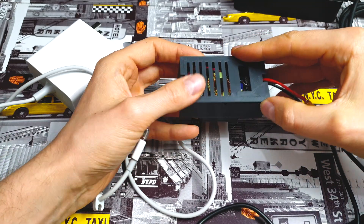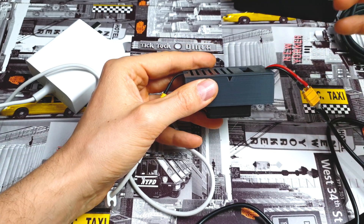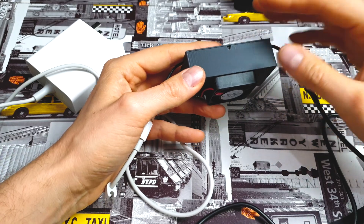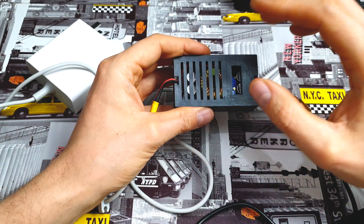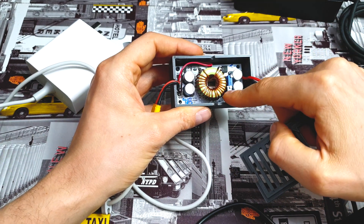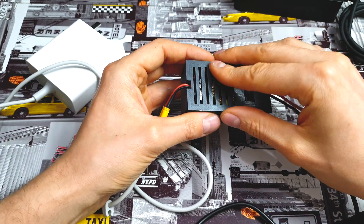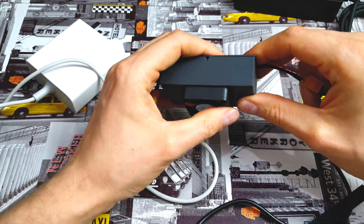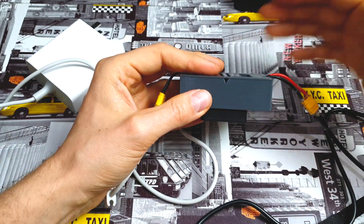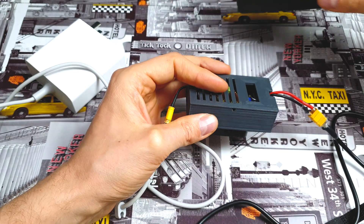Now let's do some tests to prove it's working. I did some long tests yesterday — I charged my Xiaomi Pro with an extra battery for over 30 minutes and noticed the temperature of the shell was only 30 degrees. The hottest part inside was the coil at about 45 degrees, but anything under 70 degrees is fine. This magic box charged my Xiaomi at over 1.8 amps — the same or better than the huge stock Xiaomi charger. I'm impressed.